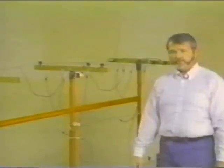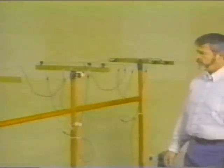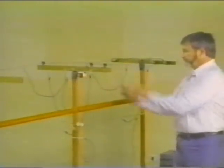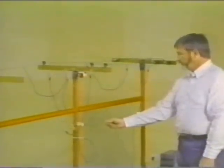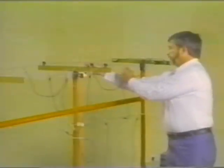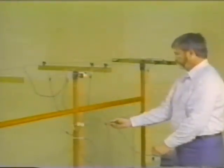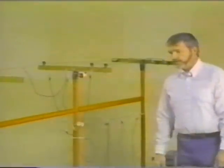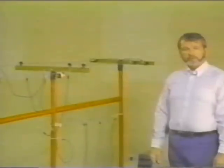Now let's drop back to single point grounding. By definition, single point grounding is a single set of grounds installed at the work site. All right, let's do that. We'll do that by eliminating one set of grounds. And at the same time, you've probably observed by now, we've committed what we always thought was one of the cardinal sins of grounding.